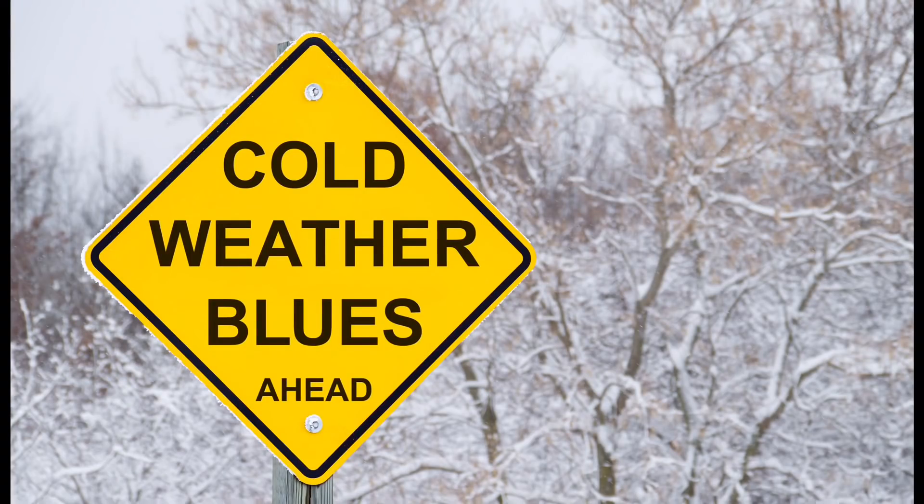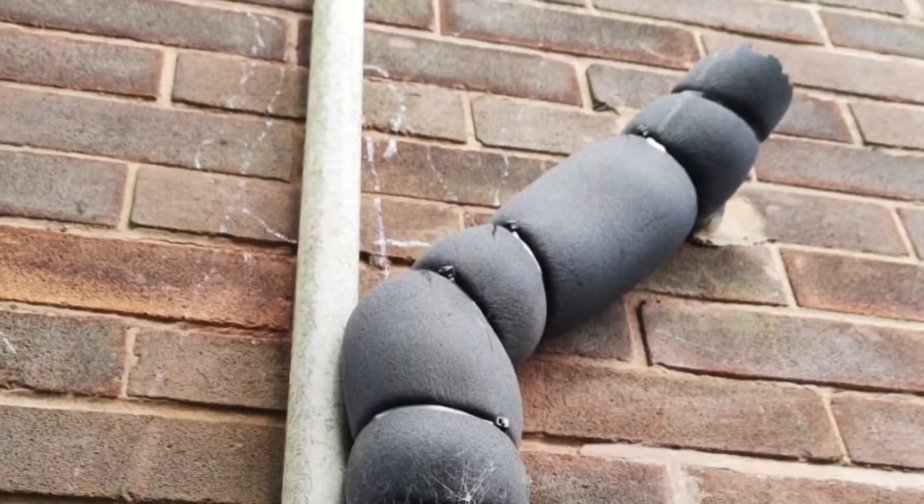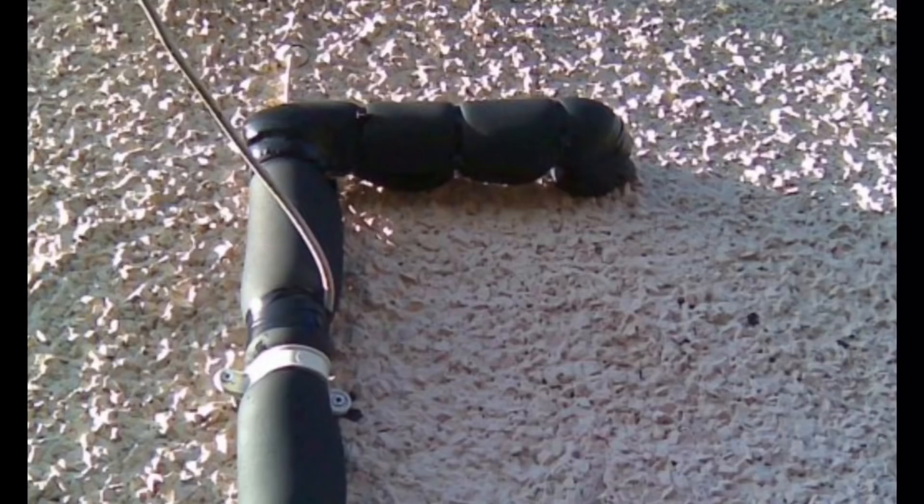The purpose of this video is to try and avoid boiler breakdowns. What tends to happen is in the coldest part of the year, in winter when we need the boiler the most and the boiler is condensing, the pipe that you've got outside tends to freeze up. I'm going to show you the journey of the condensate pipe and how it's evolved, then show you the solution, and also ask you some questions about what you do as an installer to protect the condensate. I've been using class O lagging and I want to ask you about that as well.